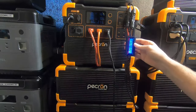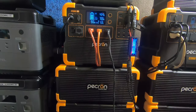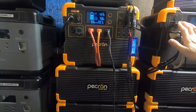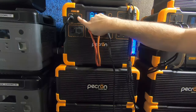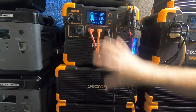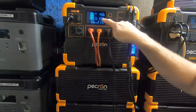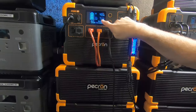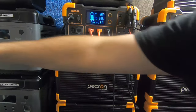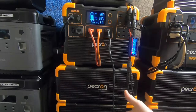Try to run them straight through. I keep the meter on for the video so you can see the numbers. The one thing I really wish this system had is the dual input that the E2000 has — a second MPPT controller input up top. Even so, when a second array feeds through the batteries, this power meter understands it. Right now I'm burning about 600 to 700 watts because I have a heater on — I'm going to overfill this today and I hate losing extra power.